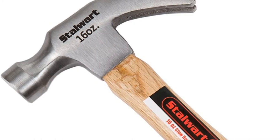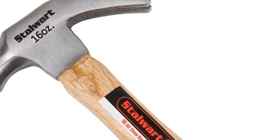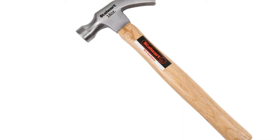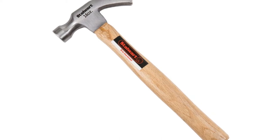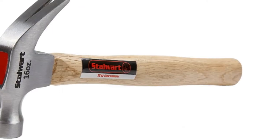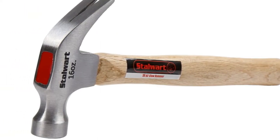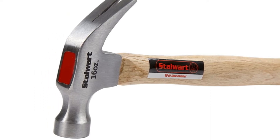Though it's not as sturdy as other hammers we've tested, it would not be our top choice for heavy professional use. This hammer has a curved claw that's great for pulling nails, though it's not the best choice for demolition work. Opposite the claw, the face is smooth so that it's less likely to mark if you miss a nail and hit your material instead. Overall, it's a great deal for the price and we're confident that you'll agree.